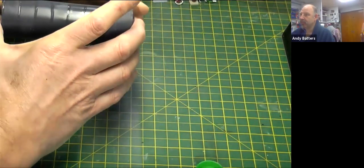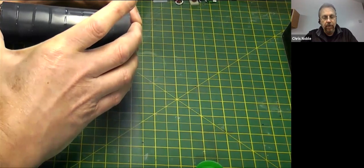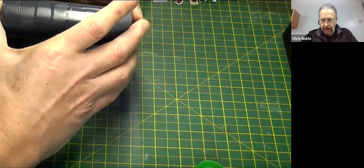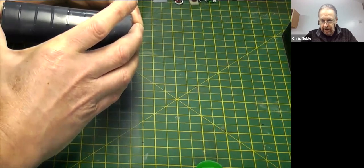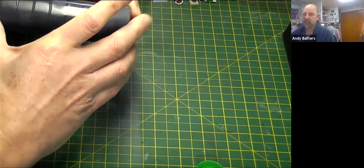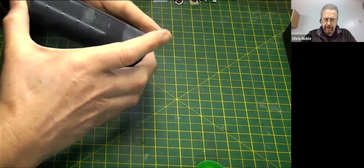That's quite good. And what I've got in mine is a 3 or 4 mil mild steel plate sitting on top of the honeycomb, and the reason why I've got that is, and Tim will keep me honest here, but the mild steel I believe is not very reflective, whereas aluminium is an absolute nightmare, and I wanted something really flat so it absorbs the laser and kills reflections. That seems to work quite well.